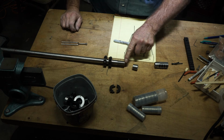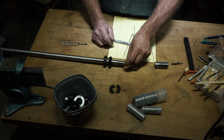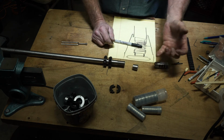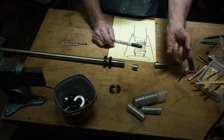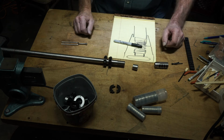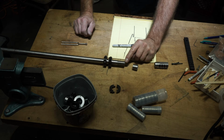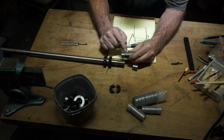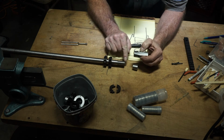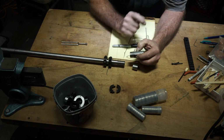Because there's some tolerance in here, let's just say that's no good because it's not a compression fit, it's not an airtight fit, it's a buzz fit at best. It's like you're playing a guitar and you back your finger off and all of a sudden that string starts to buzz against the board. That's the best that you can get here unless you deeply jam this. Now, you can get that slip fit, then put a taper, then jam it against something in here.